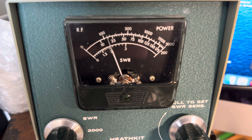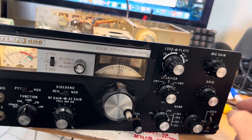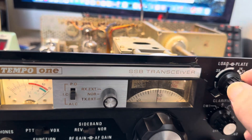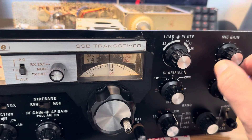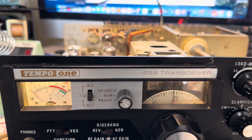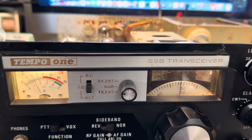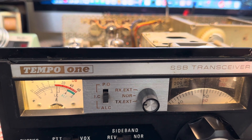15 is squirrelly, that's for sure. Let's back off on the load — a little more load. I had 15 putting out a lot of power here. A little more load — it's really pinning now. Okay, that's too much load. That seems more reasonable, but we're pinning too much plate current. 15 on this thing is difficult. It seems like 15 needs some adjustments still. 25 watts — if I could make that slug move, I could probably get 15 to put out some decent power.